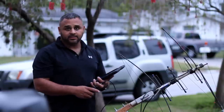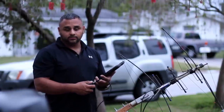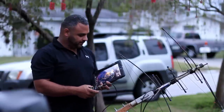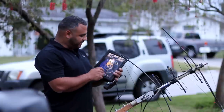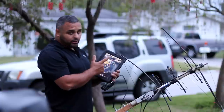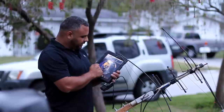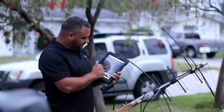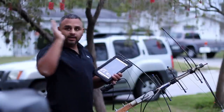I'm going to try it this time instead of using the MFJ1717S dual band antenna, which works, just not quite as well as this Cubix dual band antenna. I'm using ProSat here on my iPad to track the satellite pass. The SO-50 is just coming in range at 29 degrees elevation, coming from our southwest and heading over to northeast.